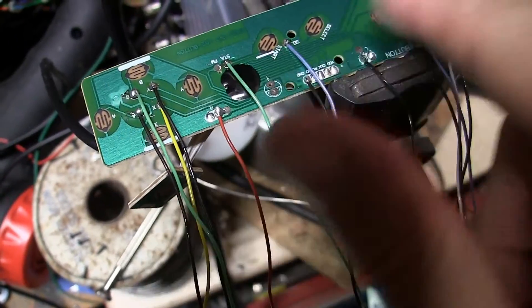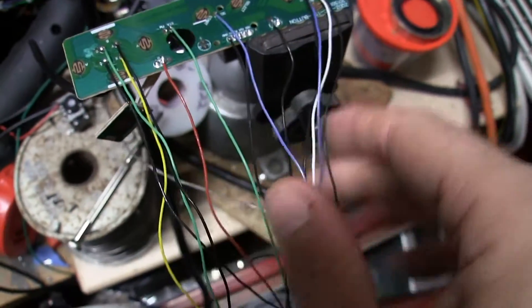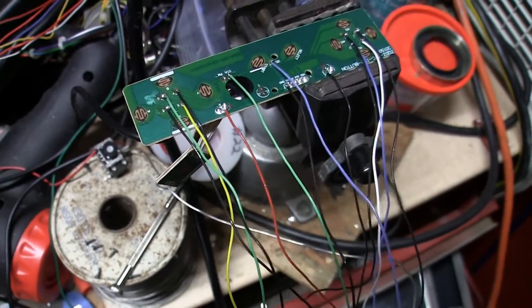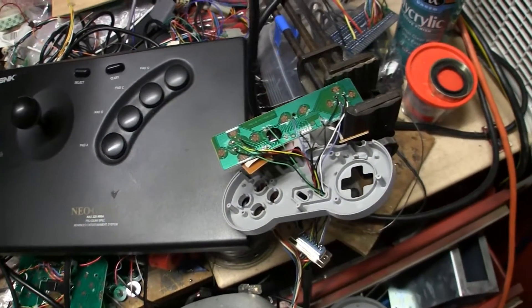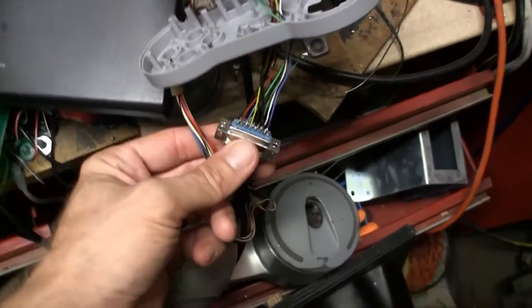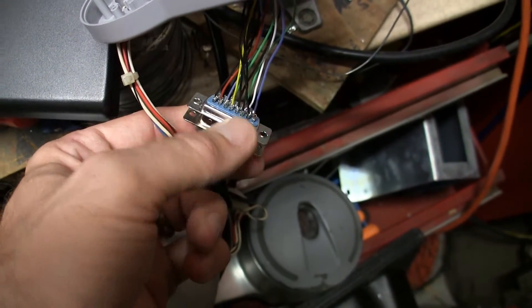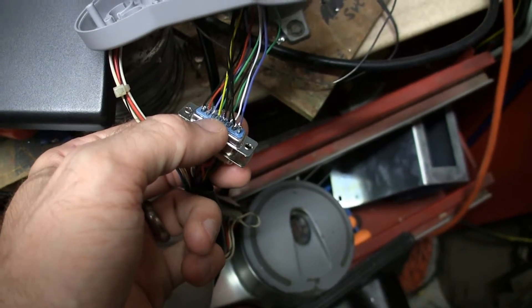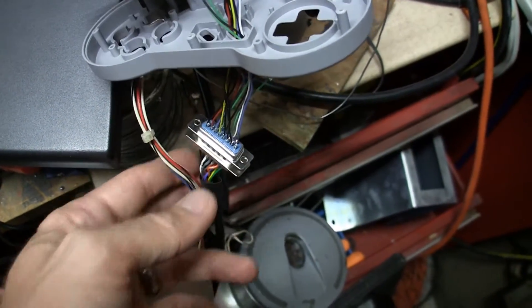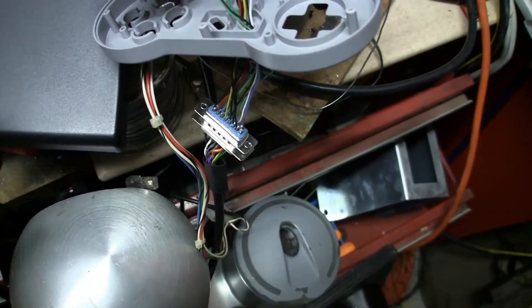Normally I'd put a little super glue on this to keep it from ever coming off. I'm going to tidy this up and start wiring my DB15. I decided to run all the wires through the front of the controller right through the Select button. The idea is I can still put the controller back together, glue the pad and the buttons on there so it looks like a controller, but it's just an enclosure. Normally I'd put little heat shrinks on the DB15 pins to protect from shorting, but I'm flat out of tiny heat shrink and I don't want to postpone this. The wires are small enough they're not really going to touch.